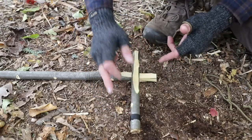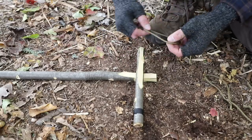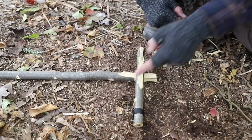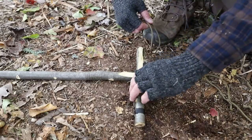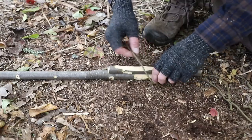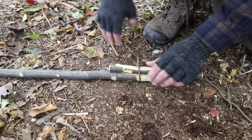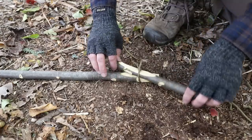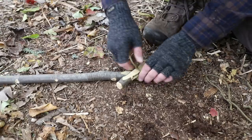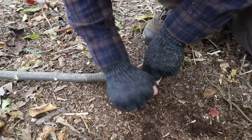Remember, our upright is going to hold our blade and also a windlass up top, so we really want that centered. I want my upright here, my blade here, and my windlass up here. So I'm going to take this, turn it sideways, and place my jam knot onto this area. I'm going to pull down just lightly — I'm not tightening that up yet. Since I want it to lay this way, I'm going to take it up higher and start to work that jam knot into place, pulling it good and tight to get it seated as tight as I can.